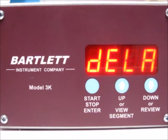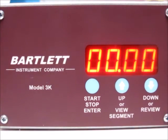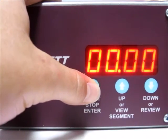Now it's asking if you'd like to set a delay time before the firing begins. You can use the up and down arrows to change it — it goes by hours and minutes. I'm going to leave this at zero, so press the stop start button when you're done.